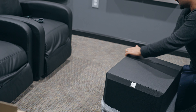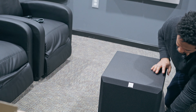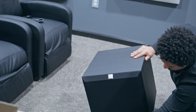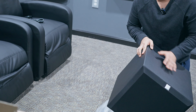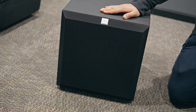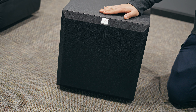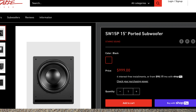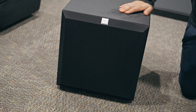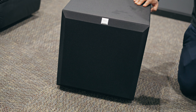This is a very budget-friendly subwoofer, and that's probably the main reason why I decided to get it from them. I think what you get for this price point is definitely impressive. This is their SW15, their sealed 15-inch sub. The reason I went with the sealed sub rather than their ported one — I think it's the SP15 — is that the ported sub can provide more output, but I wanted something that provides a more even bass, and I'm used to sealed subs anyway.